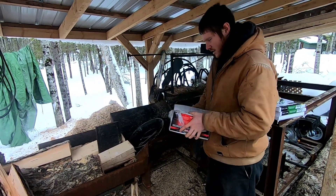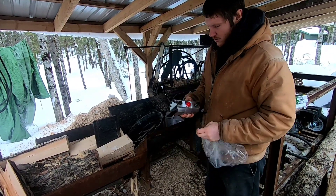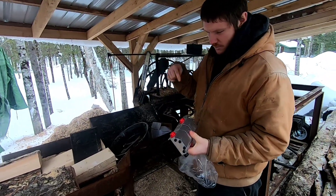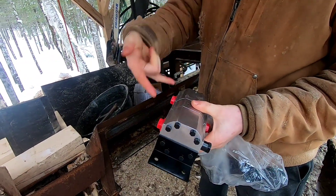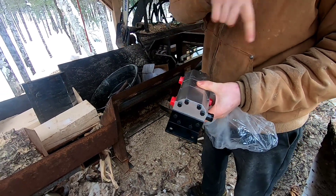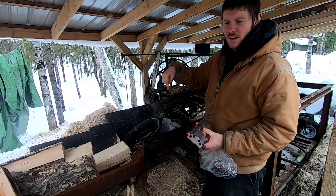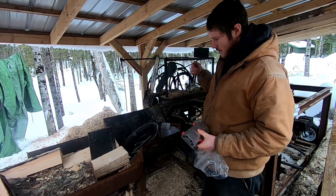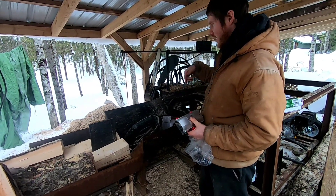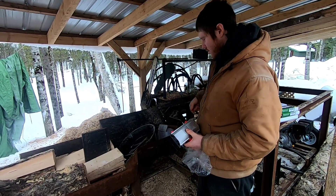So I got this thing here, which is a rotary flow divider combiner. Basically I should be able to loop the lines around. You've got your inlet and your outlets — two inlets to a single, whatever — so I should be able to get it to go both directions. Basically I should be able to make a loop around the cylinder so there's not actually more flow going up to the valve. It's actually just going back around, so the same flow should be going out, but I should be able to get one and a half times the flow through the cylinder.